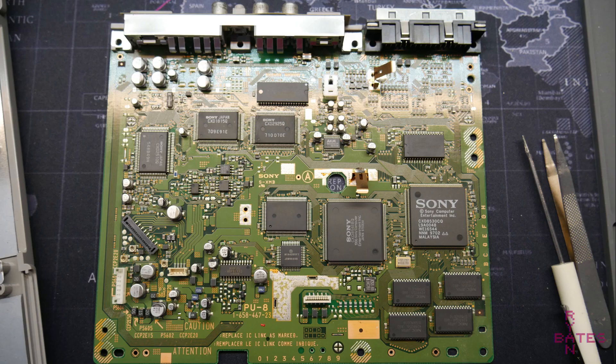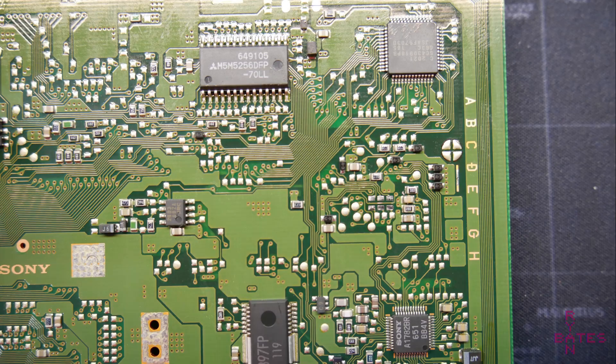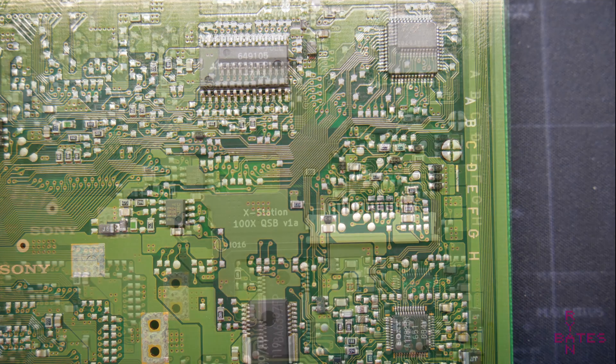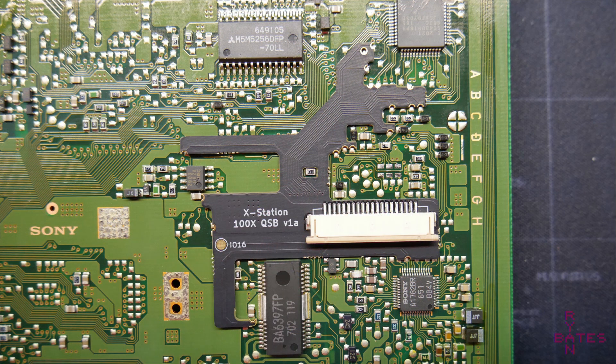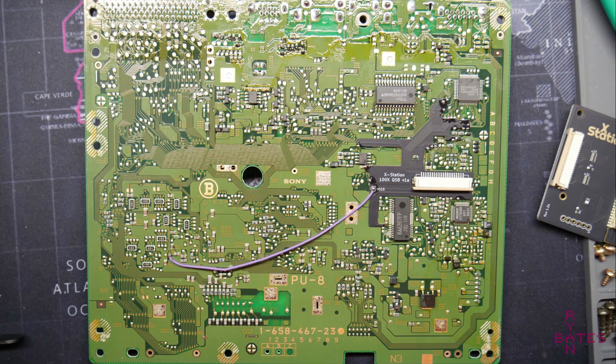After that, the rest is somewhat simple and just requires some fine soldering skills. Next, you'll desolder a capacitor and a resistor adjacent to the 67MHz oscillator, then flip the board over and remove these resistors. Now it's time to attach the quick solder board. This connects all the jumper points you need, and is done rather elegantly with this custom PCB. It is quite the task to create something like this with dimensional accuracy, so this is definitely a mod with some good engineering. I taped this board in place and soldered all the connections per the instructions. Finally, you need a long jumper wire — which is not included — from this quick solder board to the PlayStation's main board, and that concluded all the electrical service needed for the install.